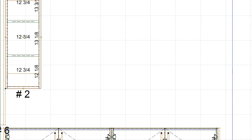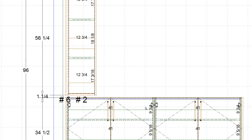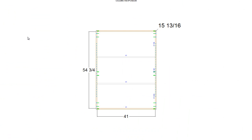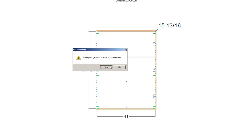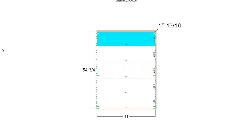Did that one. I'm going to take the height, and I'm going to go plus 14.75, so make the filler and this cabinet the same height. Same thing down here. I already know that the width is 42.5 for that base cabinet. So there we go. As your cabinets get taller, we automatically add more shelves in, so do not worry about that. This cabinet would have 4 shelves.